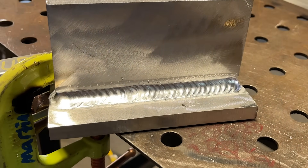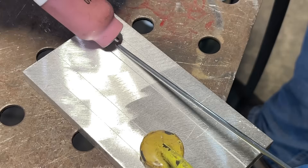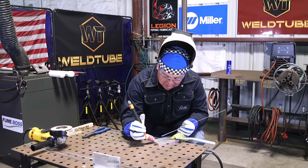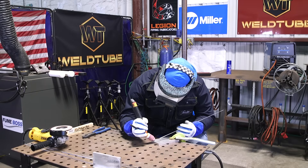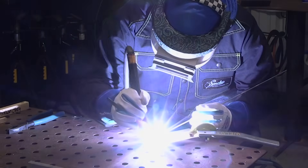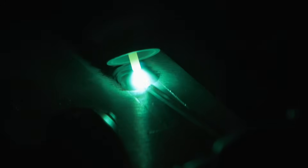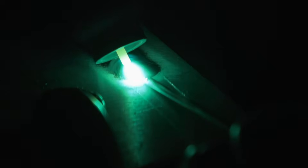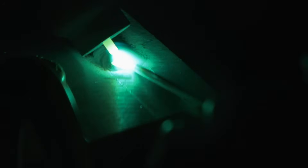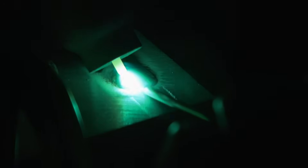Alright, so I'm going to go ahead and just walk a bead on top of this plate. I already have some lines scribed in here as a guide. And it'll be a walking motion just like on pipe, plate, typical walking the cup — just maintaining a puddle. I got the same settings as before on the T-joint, 240 amps. Alright guys, so I'm going to go ahead and start our first walking the cup bead on top of this plate. Firing up here, start heating up the base material. Get it nice and hot. Look at the nice shiny puddle you got going. Then go ahead and start adding some filler metal. Here you're going to want to have a constant kind of feed of filler metal. You don't want to make it run out — it's really hard to restart that puddle. Just keep a nice, constant feed. Keep a nice, constant walk, even left to right. Just like any other material. Watch your puddle, watch the edges where you're stopping, and just continue to walk all the way through.